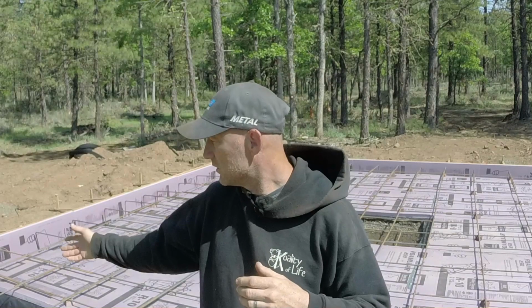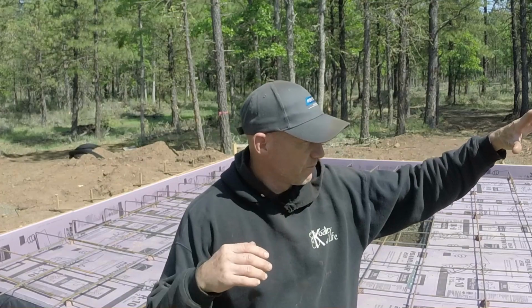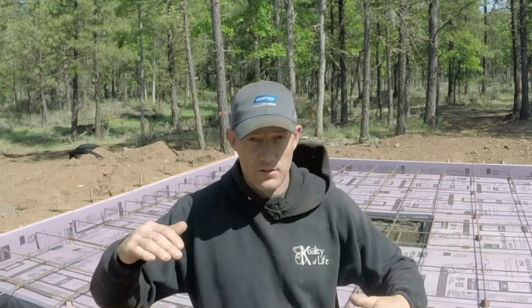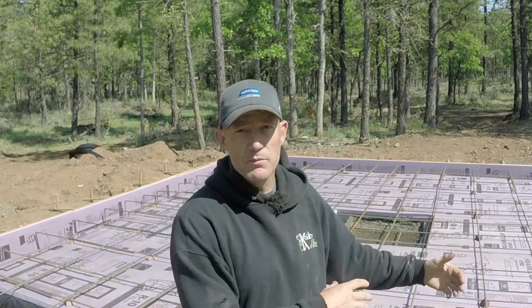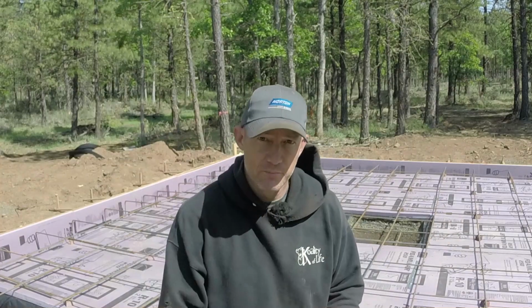And the longer bolts, the 24-inch bolts that go where the shear walls go, the reinforced walls, because of all the big windows that I mentioned, those big long bolts, he wants to see them tie wired in place, because we're going to pour the footings first and then we're going to bring trucks in to pour the top. That concrete in the bottom is going to start to harden up before we pour the top. So you can't just take this 24-inch bolt and stuff it down into that bottom part. It's already going to be getting hard. It's not going to end well for me if I don't tie wire them into place.